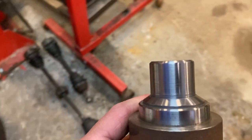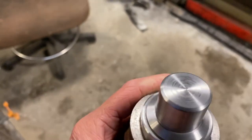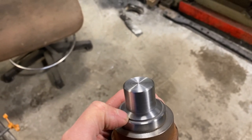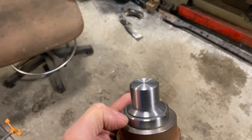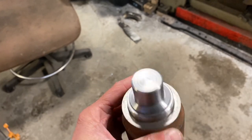That's the male side done. Now I'm going to make the female side, which is basically a mirror of this but leaving a slight one millimetre gap for the chamfer to create the dimple. Let's get on with that and get this sorted out.